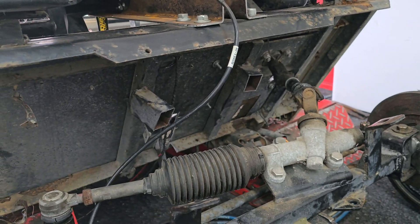As you can see they're all welded on now, all makes sense. What we need to do now is make up four hangers so we can mount them into the cart. We're going to use the bolt hole spacing that's already on the cart to save mucking around on the front axle and on the body, and then we just need to make some sides to hold this in and some spacers to make up the difference, and that can't go nowhere.